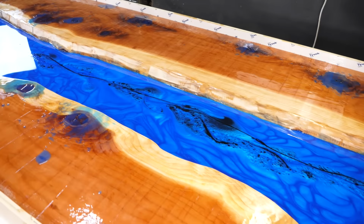All right, for best curing options, I'm going to have my room at about 70 degrees, 70 to 75. I'm going to turn off the lights. The lights leave a reflection like you're seeing there. The bugs fly into the reflection, and then they're Jurassic Parking themselves into your tabletop. You can sand them out the next day, but you're going to have to do another flood coat.